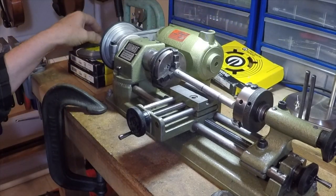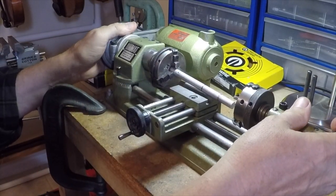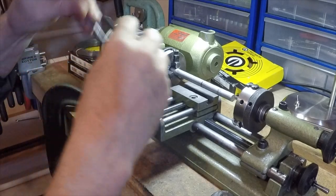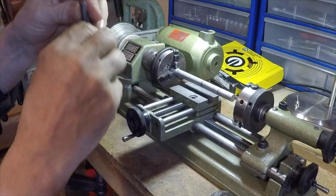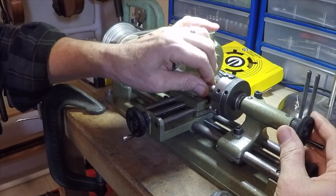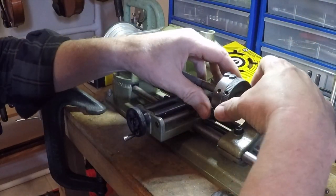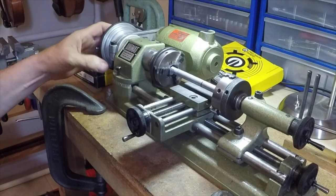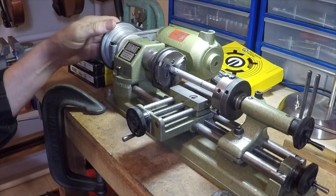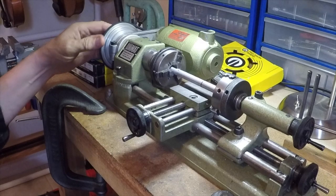What you really want to do is make sure that you have a solid base. Everything is clamped down so nothing moves — it will be very solid. Clamping in the rod, and having some sort of system that the rod can actually float into. I'm particularly using this lathe with another three-jaw chuck on this side, just enough to give me some ability to rotate. There are lathes out there that will actually rotate this slowly — I would love to have one — but my lathe runs at a rather high rate of speed, so I would have to spin it too quickly.